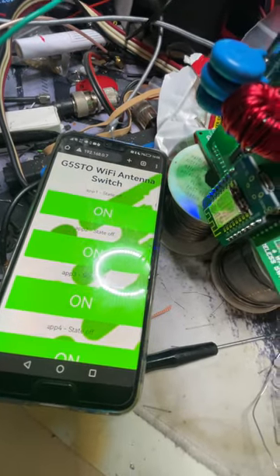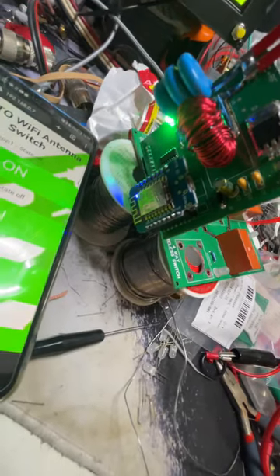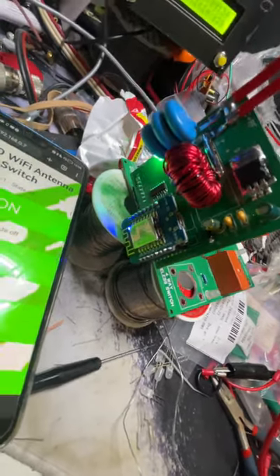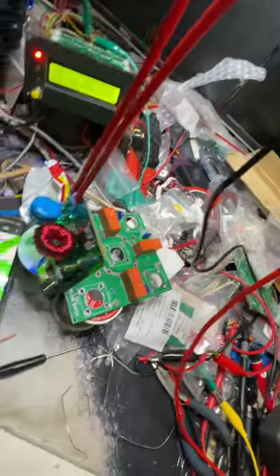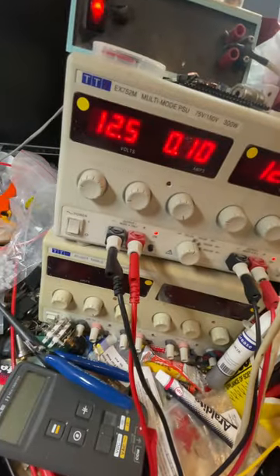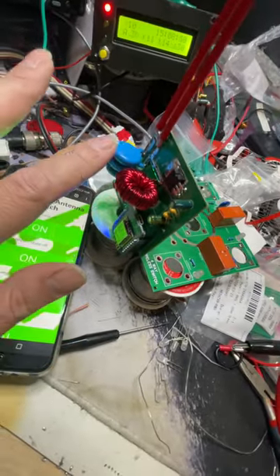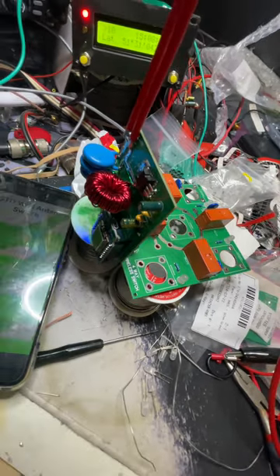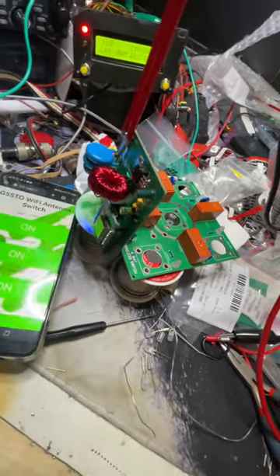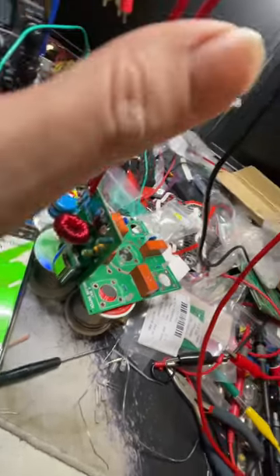There's the GUI on the phone — which is about to run out of battery — and there's the actual board. We've got a Wi-Fi board, there's the basic bias-T. I'm just running some lash-up wires, 12 volts on the power supply going up to these wires, then protected by the bias-T. So our RF is blocked here and DC is blocked from here. These 10 kilovolt high-voltage capacitors are making up the bias-T circuit.